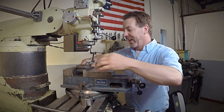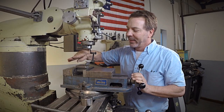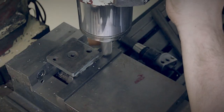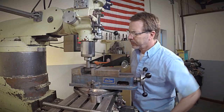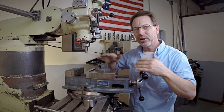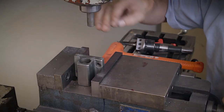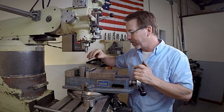So now I got really lucky — it lined up right on the parallels just perfect like it's supposed to. It is tilted this way a little bit, and that's actually okay because this plane matters this way; this way it doesn't, with the way the cutter is going to fit in there. That's a pretty nice casting — very, very square. I want to show you how I'm going to set up the nut now that we've got this all squared up and ready to go in. Whenever you clamp into the vise, always get that center pressure of the screw. If you go on one end or the other, the vise jaws will twist a little bit out of alignment and maybe cause you problems later.